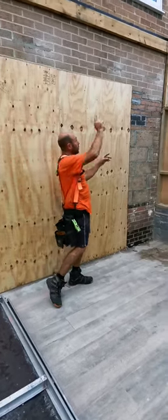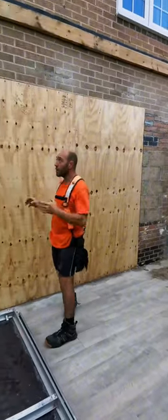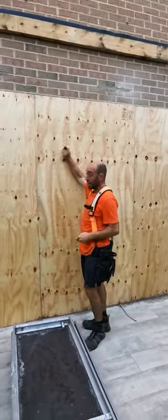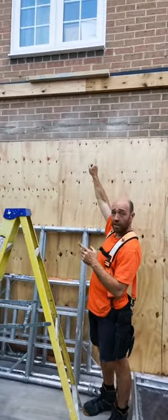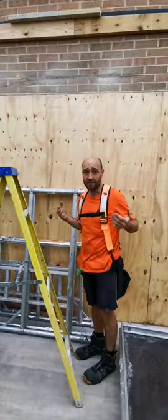Now when I'm doing this on my own, I will put a timber in the end to hold up the plate. That way when I come along with my ladder, I get up and hold it, fix it in - the pipe hole's already done. Then when I come a bit further through, I'll get a piece of timber on top. I hook it on top, straight over. I've got the chalk line, I know where I'm going - just makes it easier and frees my hands up.